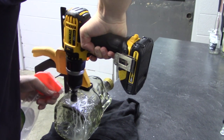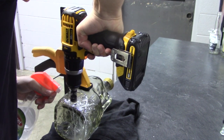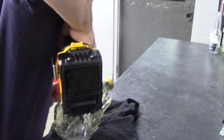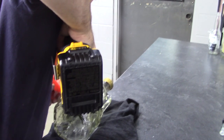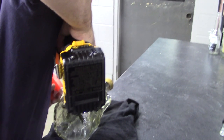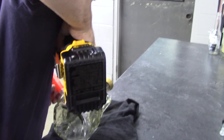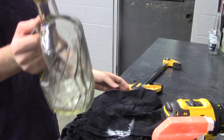As you're drilling, you want to let the drill bit do the work. Don't push down too hard. Pushing down too hard is unnecessary and it will tear up your drill bit. Also, once the glass starts to get thinner, pushing down too hard will crack the backside of the glass. So once the glass gets thin, don't press down as hard — let the drill bit do the work. I was actually pressing down way too hard here. Don't be an idiot like I am.